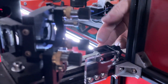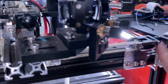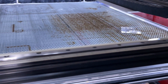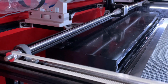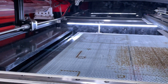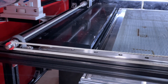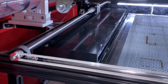For the Y axis, we have something similar — another belt tensioner adjuster. I still have the acrylic on here; there's not as much tension on this one, but I may replace it as well at some point. That belt runs along the horizontal down to the back, where you can see a gear and a long shaft with a double-shafted stepper motor, and then a matching mount on the other side. Standard belts — I was going to put larger belts on, but these seem to work fine.